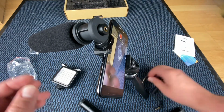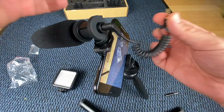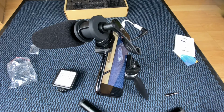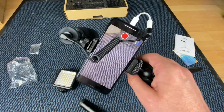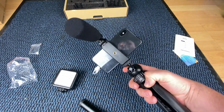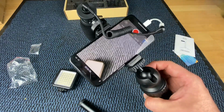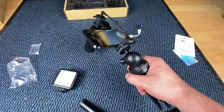Transducers, electret condenser, the polar pattern is Super-Cardioid, frequency response is 50 Hz to 14 kHz, sensitivity is -40 decibel, ±3 decibel, and the signal to noise ratio is 70 decibel, the maximum SPL is 130 decibel. The cable is TRRS audio cable with 3.5mm plug. The plug adapter is TRRS to TRS. The dimensions are 13mm in diameter and 126mm length.